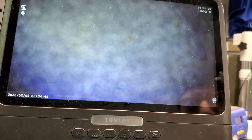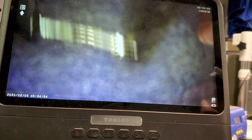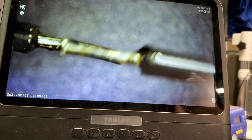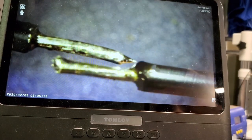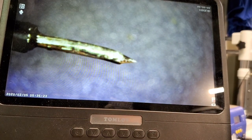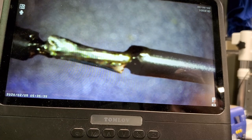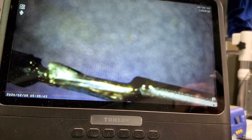This one here, and this one here. I'm going to put them side by side so you can really see what happens. My tip is a little dirty so I'm going to clean the tip, apply some new solder to it, clean the tip again. Here we go — wires parallel to each other. Melt it, run it down — you can see it bleed from one wire into the next. There we go, look how fast that was. Let's inspect it under the microscope.